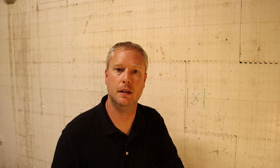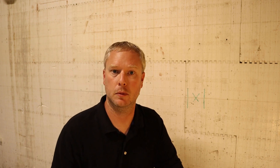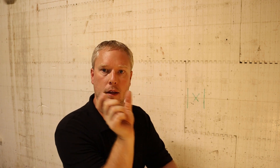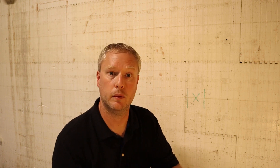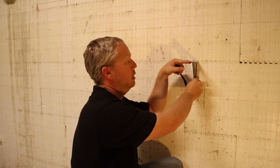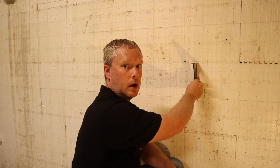Once you know the height of the bottom of your truss, mark it on the corners of the stretch you're doing, put a block in place with a screw, and stretch a string line across. The string line should be set out from the wall three to four inches. Then take your speed square, put it against the wall right up to the bottom of the string line, and make your mark for exactly where the bottom of the truss needs to go.